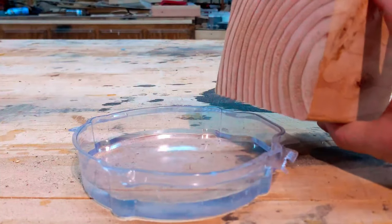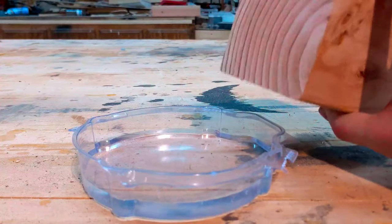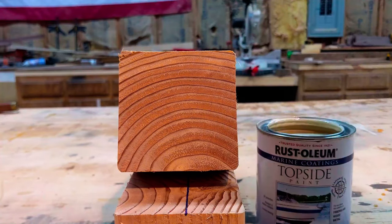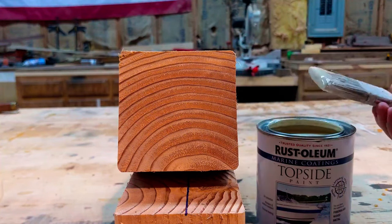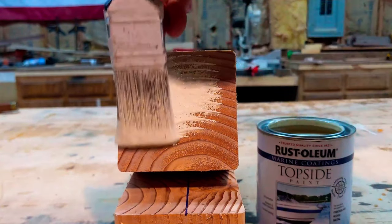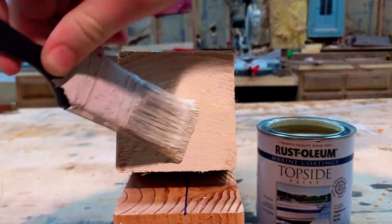There's just a little demonstration of what happens if you don't coat the bottom of your 2x4s when they're in contact with the ground outside — there's going to be water and it's going to rot out. That was only about a 5-minute time lapse. So I highly recommend, whether you're using pressure treated or non-pressure treated, to get some type of paint. That Flex Seal stuff will work great for this. Just take the time to paint the end grain of your pieces, make sure you get a nice heavy coverage all over it, and you're going to see how quickly it actually soaks into the wood.